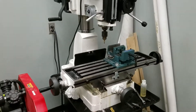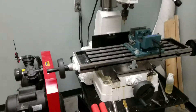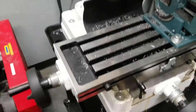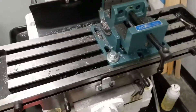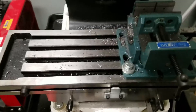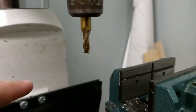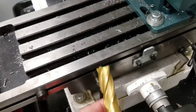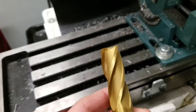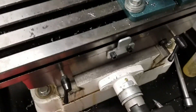Today let's look at this mill drill. It's got all the functionality of a drill press, but it also has this XY table so you can move left to right or front to back. The idea with that is you use these edge cutting tools — they're not normal drill bits, they're designed to cut into the side rather than drilling down. They come in various sizes; this is three-quarter inch. It doesn't have a drill tip, so you have to drill your hole first and then do your edge cutting.